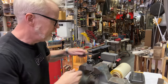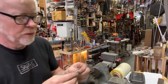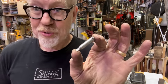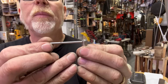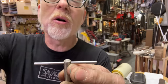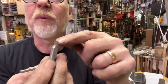All right. I think I have almost everything I need. So here is the body of my new chuck key. And here is the handle. I'm gonna try something interesting here. I've put a little notch in the handle here. I'm gonna put this in here, and then I'm going to give a little boonk right there and see if I can hold that there. Also with a little Loctite, let's do both. Then I have my little, yeah. So first I'm gonna round this off on the 3M wheel.